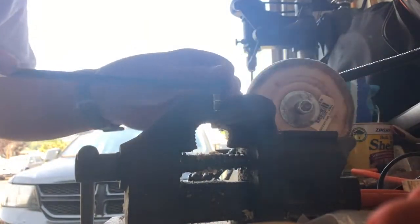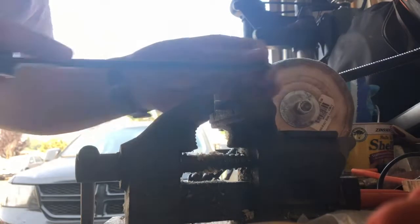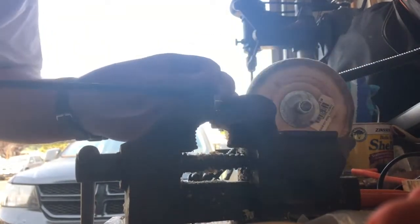After I installed the bushings I went ahead and ran a smaller diameter bit the same size as the post inside a standard spur point bit and drilled it slightly deeper in order to get a little more depth out of it without the spur point of the Forstner bit risking poking out, and gained another 1/16 inch of overall adjustability.